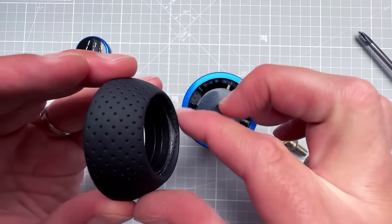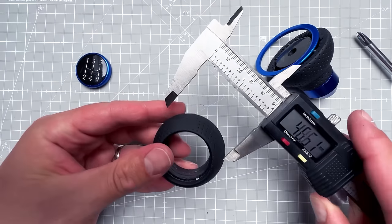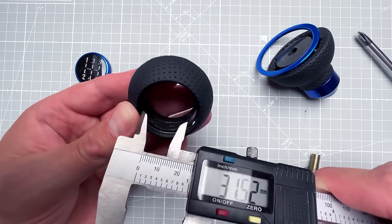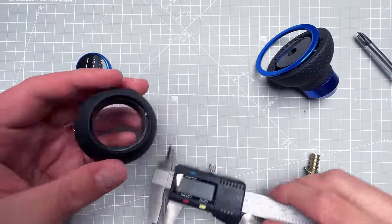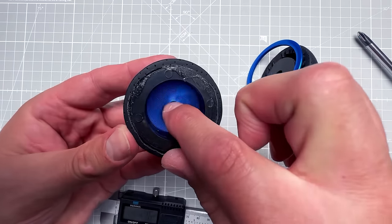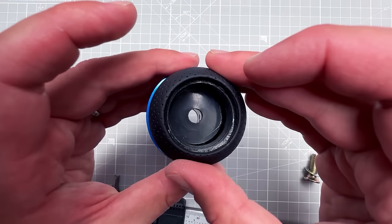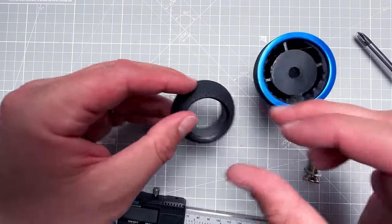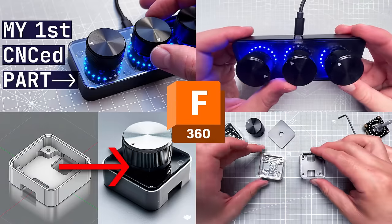You've already seen the finished product, so you know I didn't stop there — but we'll get to that. The first step was to take calipers and measure the piece. You can use the jaw part of the calipers to measure inner distances, and the depth probe to measure hole sizes. I want to make one small modification: previously the bolt went all the way through to the top piece, but since there won't be a top piece, I need to add a floor with a hole so I can place the nut on the floor and bolt everything together. With all measurements taken, it's time to create a 3D model in Fusion 360.